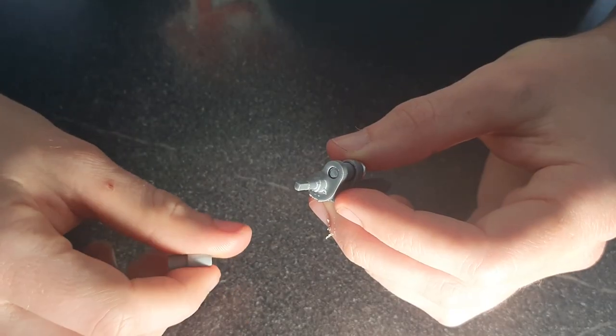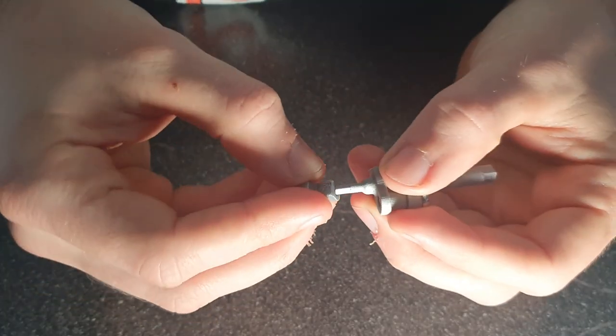So I decided to redesign the rear crankshaft part. I removed the need for a screw by using a square shaft on the rear crankshaft part which connects into a square slot on the rear bearing part. This way there should be less movement and I can make sure that I get the rear bearing part in the right place.